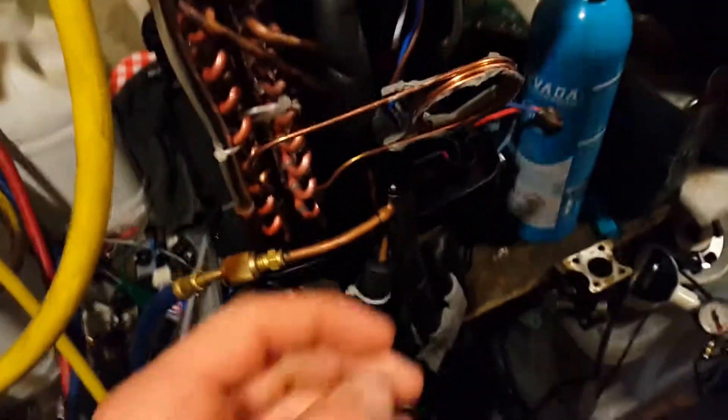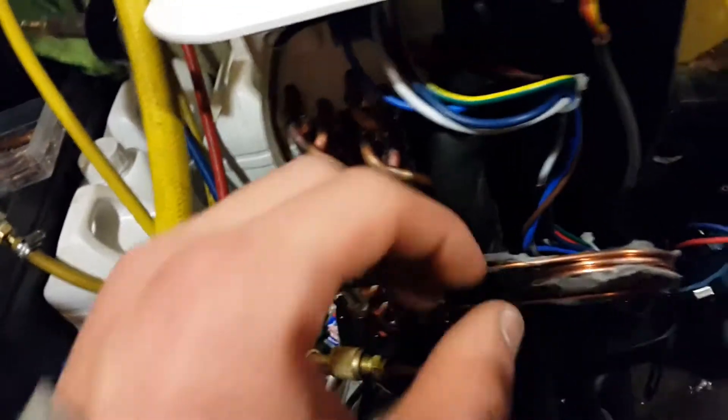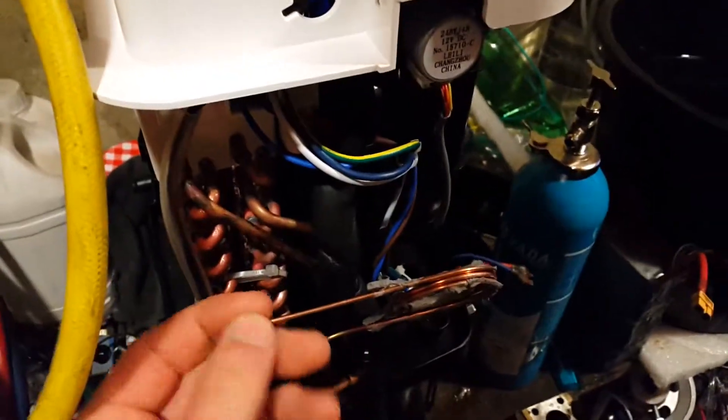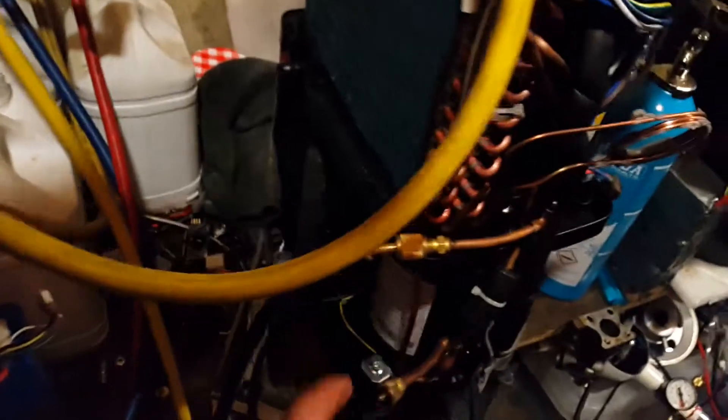It's still running and we haven't actually got any water to fall off it just yet, but the compressor is now too hot to keep my hand on for any reasonable amount of time. So I think there's going to be changes made to our metering device here — well, it should be more or less restrictive, I'm not exactly sure. It is working to a certain extent — just about — the whole thing has now got condensation on it. Once I change it into an air conditioner I'll probably be able to iron out all the problems and find out what size this capillary tube is as well. I'll update when I get onto that project.